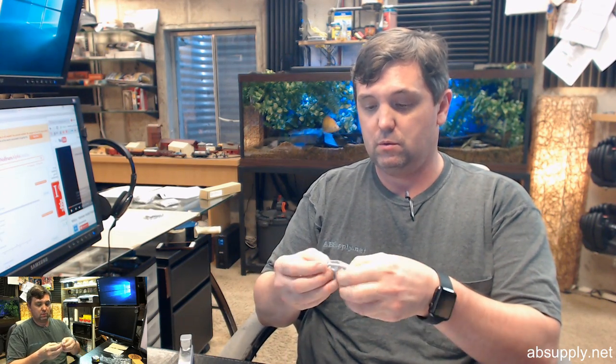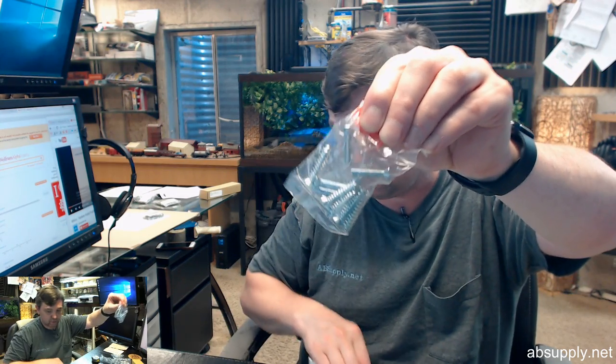There is a link below this video to installation instructions, and basically they give you locations by which to position the bolt and then drill and tap for the holes. Drilling and tapping is really important with a surface bolt, provided you have ample steel thickness there, minimum 14 gauge, they say, in order to create the holes that you need tapped for that. And those holes are 12-24 thread, so it's the same as the machine thread for a hinge. The rest of the installation instructions call out, position the bolt, mark the holes, drill and tap, or whatever you're going to do. Through bolting would be good, sex bolting.